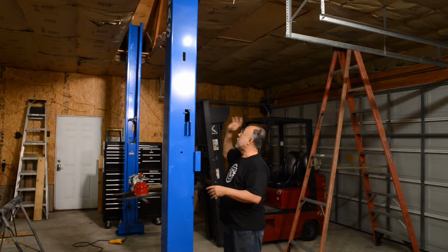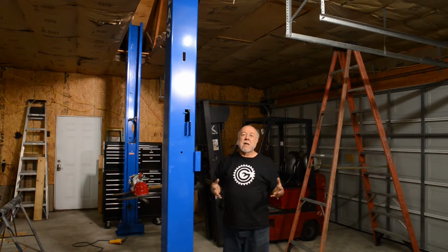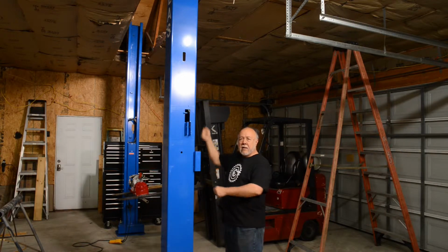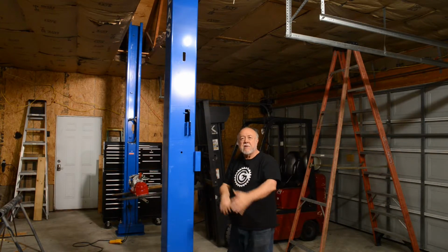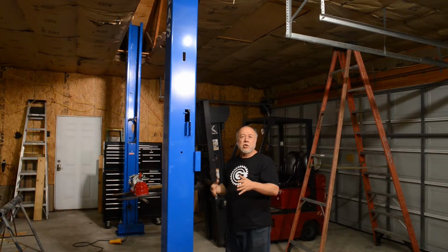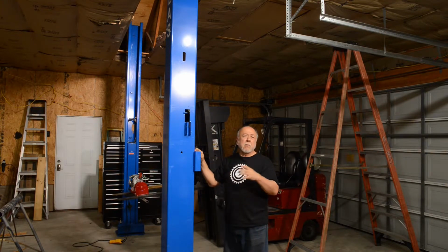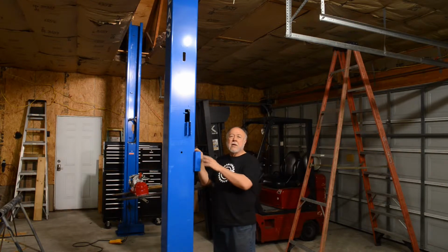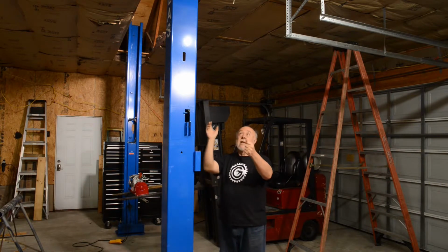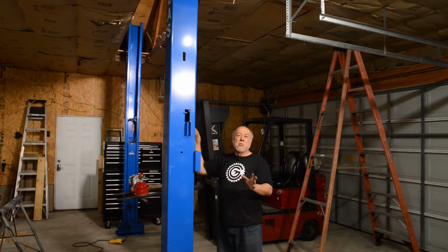I ended up putting the chain and the cross pieces back up where they were to start with and repeated the same process exactly like you saw in the last clip. We pulled it up. It lifted up as high as it could go. At that point, the column was about a 70-degree angle or so. And then my wife operated the winch, and my daughter and I just pushed up on the column. It wasn't hard. It was close to being balanced at that point. So it was very minimal effort to push it up as my wife backed off on the winch and slowly let it settle in over on this side. I didn't show it because they're not comfortable being on camera, so we just did it, and I just tell you about it.